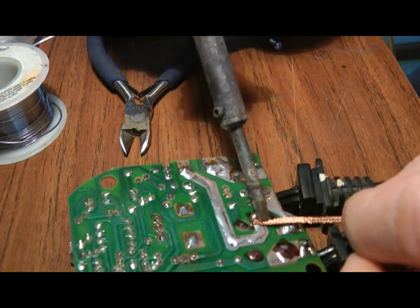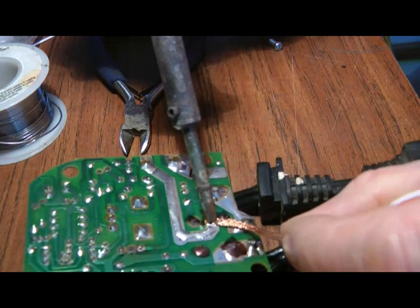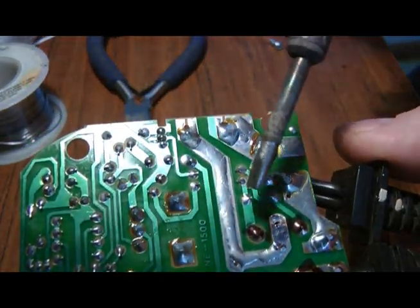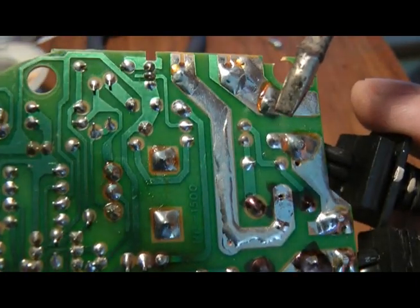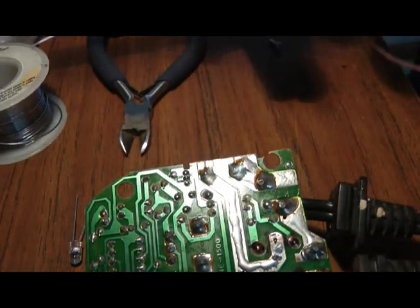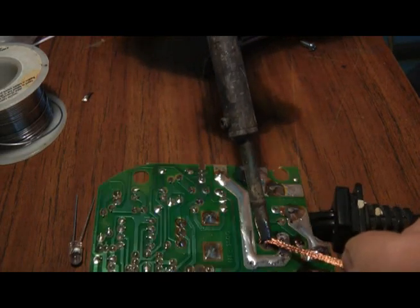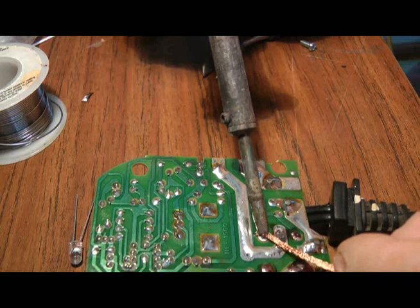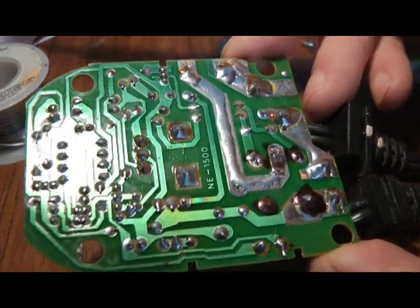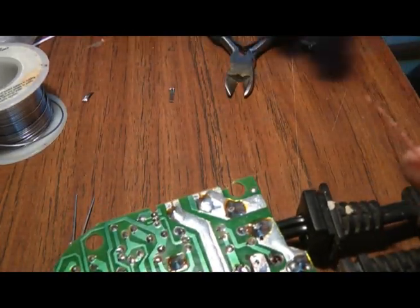So basically heat these points up, you heat the solder up, and then you put your soldering iron onto the wick, and if you're close enough you can see the solder wicking up into it. See — the solder is on that one hole right here. The solder's been pulled away from it; you can actually see where the hole is if you look close enough. I'm trying to get some reflection on it, but you can see where the hole is right there where the relay comes from. So we're going to want to do that to the other two. So basically once again — push down, clip that off. I was telling you the solder wick fills up, so you clip that end off, start again, put the solder wick on top, push the soldering iron down on top of it, and it'll fill that wick up. It's just better to do it that way, trust me.